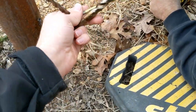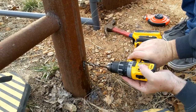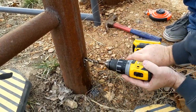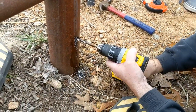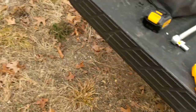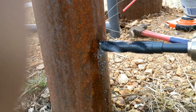Next we stepped up to a half-inch bit. As we get toward the end of the hole, the drill bit grabs again — that's where you risk a wrist snapper. When the drill goes slinging around, that can be real bad news for your wrist. You can see two tiny tabs inside that grab the bit and make the drill spin instead. Now we move up to the three-quarter-inch bit. When we start seeing smoke, the bit tip is getting heated up. We want to keep it cooled with WD-40 or slow down to prevent the tip from going dull.